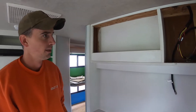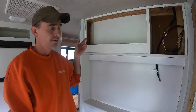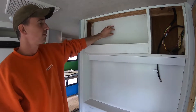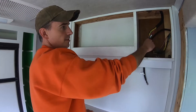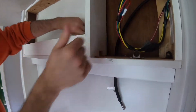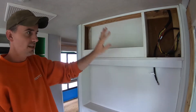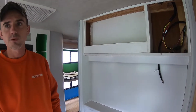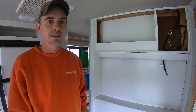This is what I did today. Before, it had this ugly black screen mesh thing that went over and it was a bunch of wasted space. So I decided we were going to make a shelf so the boys could put their Wii up here and store it. I found a piece of whiteboard from other shelving projects, framed it in, and put a little wall in with an access door to still reach wires and power. The cable cord still comes down here, and I'm going to cut a little hole to get power through. Then we'll primer this, paint it all white, sand it down so it matches everything else, the TV will sit in there, and we'll actually get to utilize more space. Put a little door so you can still pop it off and access stuff — just using dead space and making it more functional.